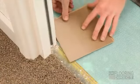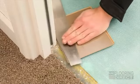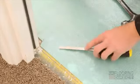All doorframe architraves must be undercut, using a waste offcut and a piece of underlay as a height guide. Keep your handsaw flat and level whilst cutting the frame. Ensure you cut the architrave out using a chisel to remove scrap pieces.